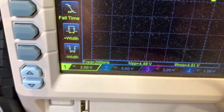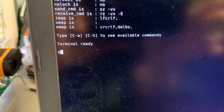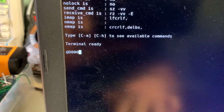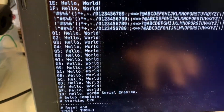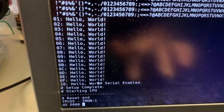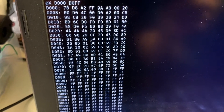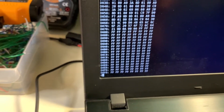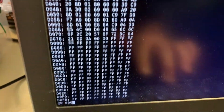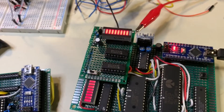From here I can show it at its actual speed. I'll pull the terminal back up and go back to the test program and run it. It's quite a bit faster now. I can stop that and examine memory — the program I just ran. It shows the memory contents in the EEPROM. I can also write commands with a similar function, and write to that memory device or the expansion board. I'll set it to A0 and hit enter — it's pretty much instant.